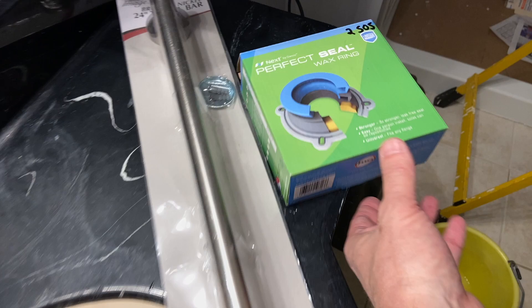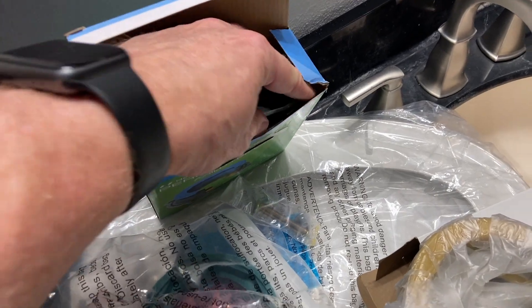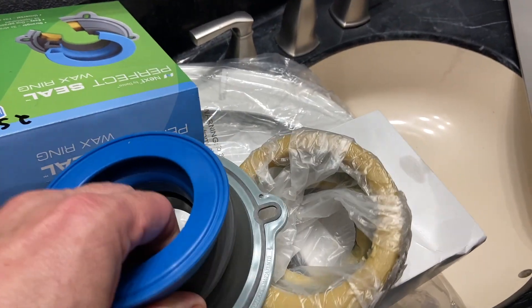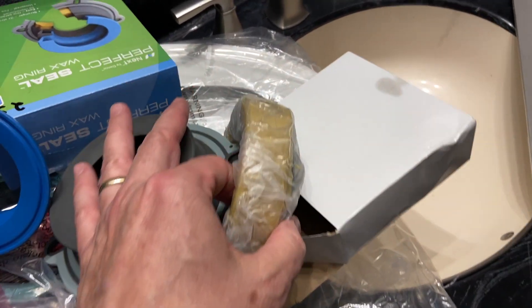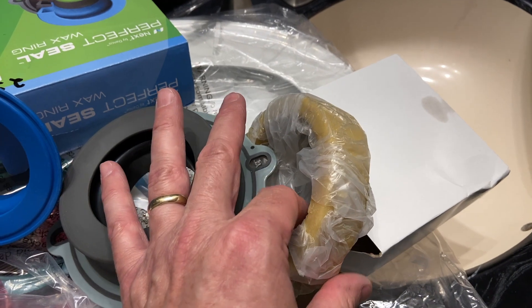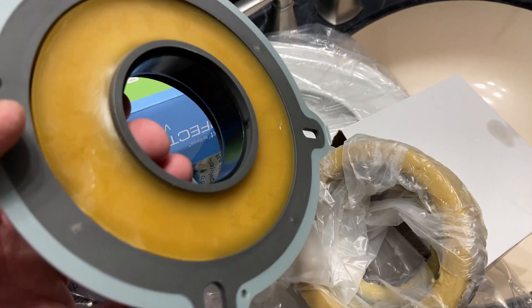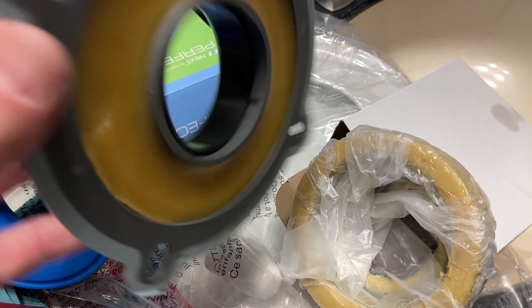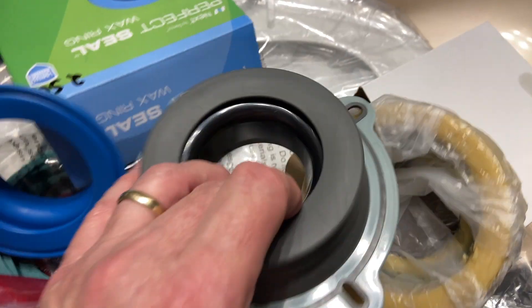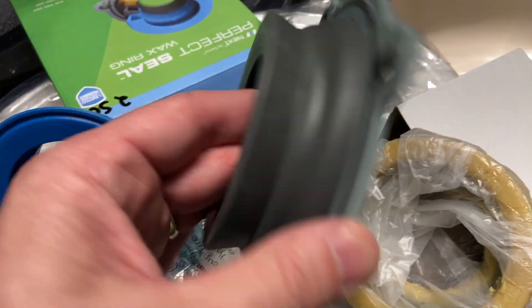There are two options: we can use a wax ring, or we can use a perfect seal system. The perfect seal is probably going to be the route I want to go with. With the perfect seal, if the floor is a little bit higher and you need more seal, some people have doubled wax rings or use extra large wax rings — or we can go with this system, where it sits down over the flange bolts. The black plastic piece squeezes down to become the chute into the floor, and the wax seals around everything once it's compressed.